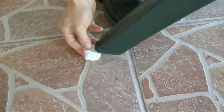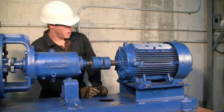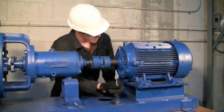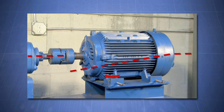Let's go back to our table example. You may stick your napkins under the bad foot and get the table to stop moving, but this is not a permanent solution. If you still have softfoot, you'll be chasing shim corrections that don't seem to match up with the alignment readings. Moves will also be difficult because the alignment of your shaft centerlines of rotation will change as soon as you re-tighten the bolts. If you find yourself in this situation, remember that it's not your fault — the problem is that you still have softfoot.